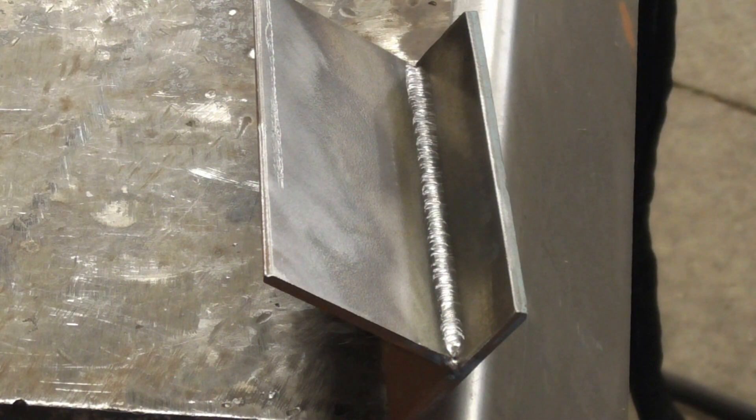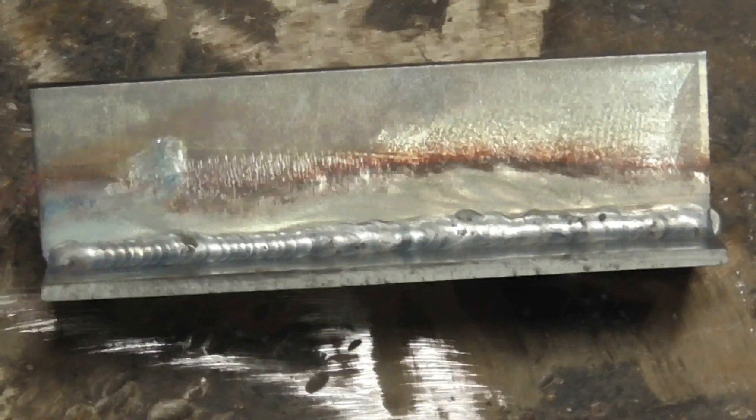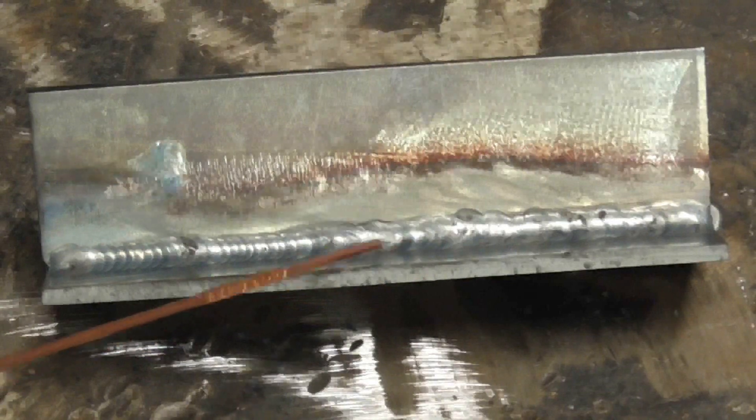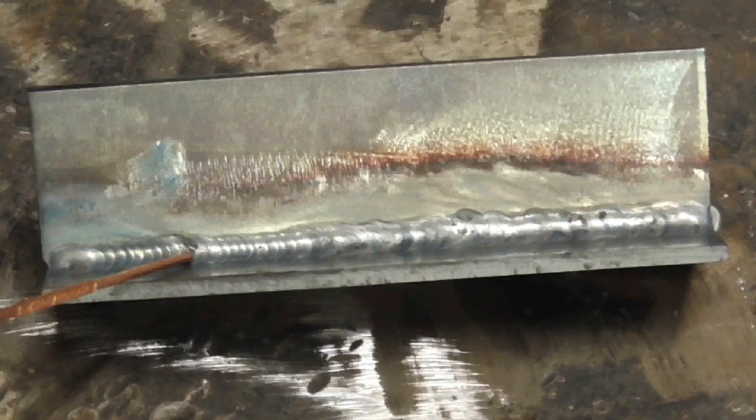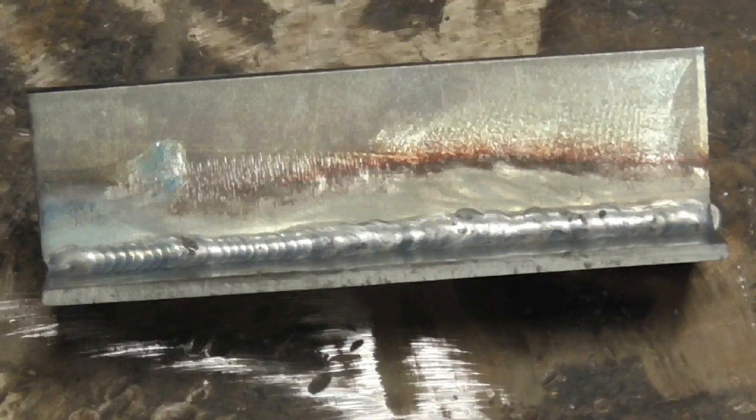Here's the final look at the weld in the 1F position. We were having some trouble when we first started because we discovered that some of our filler metal was rusty. I'll show you another one where we had really dirty filler metal in the beginning — then it straightened out — then got dirty again. This has to be really clean. All TIG welding: no mill scale, no oil, no water — it's got to be perfectly clean, and so does your filler. You can see it's really dirty through here, then it cleaned up, then hit more nastiness, then got clean again. Make sure it's clean or you are not going to succeed.